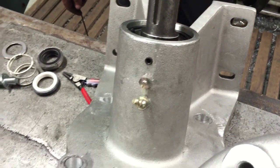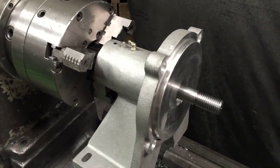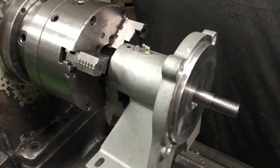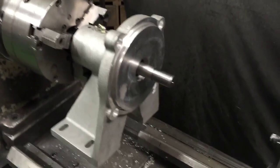It's best to grease at the end of the day or when the pump is good and warm. We went ahead and chucked it up in the lathe here, but again a vise or anything that's going to keep the shaft there works — you want to keep everything nice and straight.